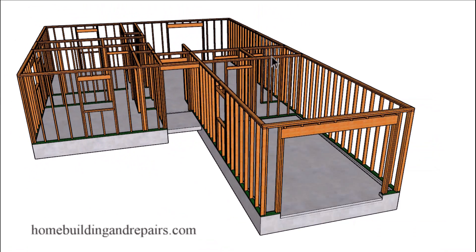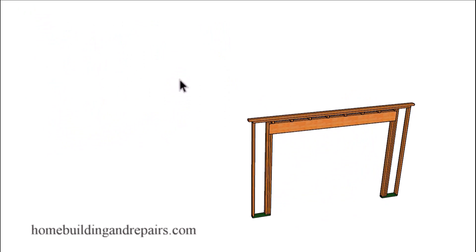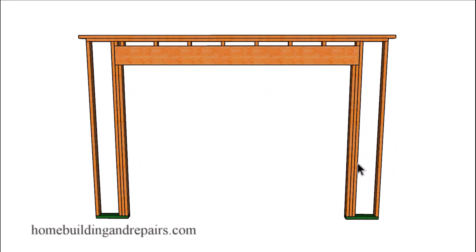In the second half of the video I'm going to go over each wall individually, showing you either the building foundation or certain sections of the house to keep your orientation. Let's start with the garage door wall, which is going to have double trimmers. Here we have a 4x10 header along with 2x4 wall framing studs. Keep in mind I will not be able to provide specific lumber sizes for building this house in your area.